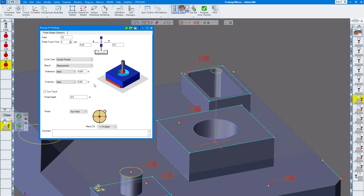Under the alarms, you can either have an alarm with a tolerance — so when it probes and finds the hole is undersized it pops up an alarm — or you can say go to a specific line number and have it recut, however you'd like to probe and continue or recut. How deep do you want to go? I'm going to go half inch deep, so I'll be inside the bore about a quarter inch. You can choose four-point or three-point; if you choose three-point it asks for the angles.